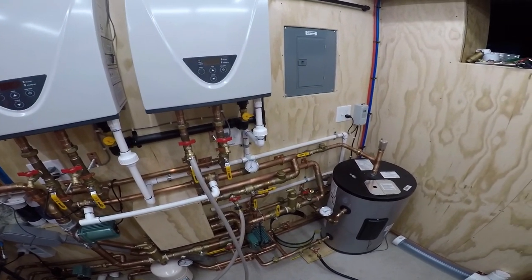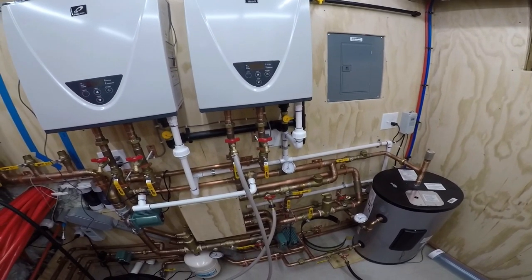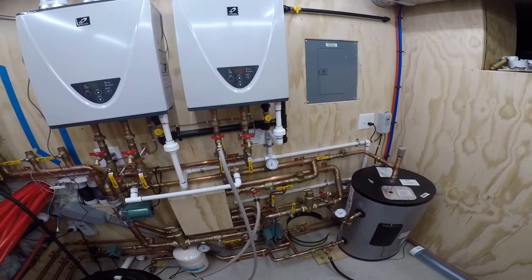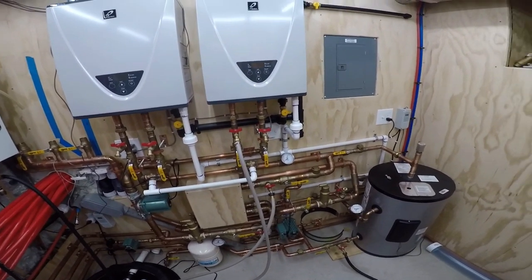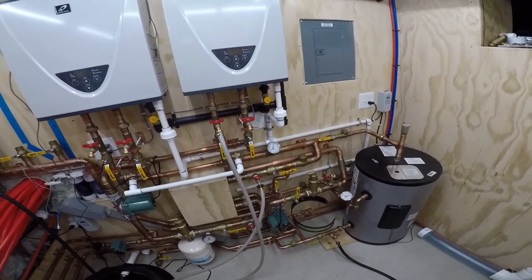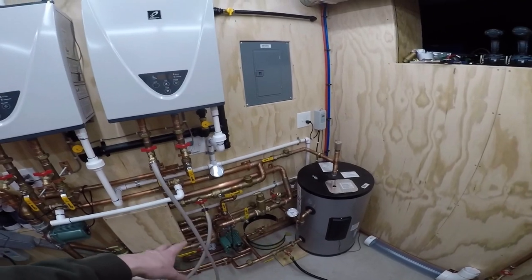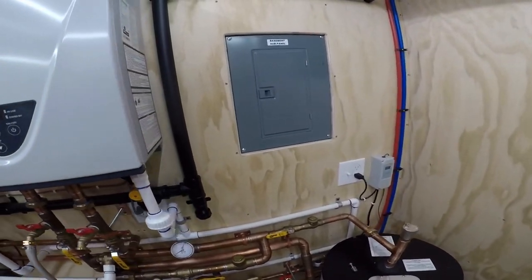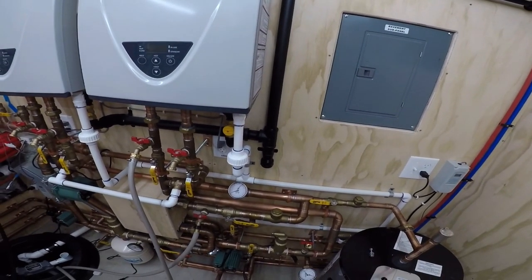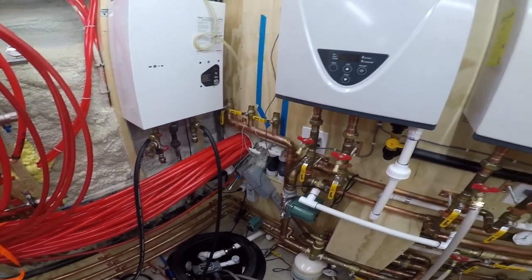It's actually the next day. I filled the system last night — no more leaks. I played around with it for quite a bit, purging and playing with the pumps, just getting things figured out. As of right now the whole thing is at 50-55 pounds. I spent probably an hour to an hour and a half last night hooking up to various valves, filling from different directions, trying to get all the air out of the system, including to the furnace and back. I had a little leak at the furnace with the PEX connections but got that all taken care of. Looking really good — I'm really happy.